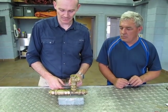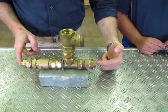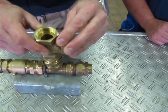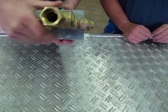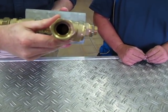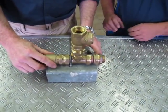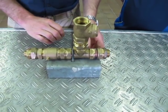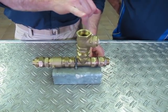The main components of the RAM pump are two valves. This is the inlet for the water and this is the outlet. This valve up here is a flap valve, a flap non-return valve which is normally open. As you can see there is a little flap here which you can hear moving at the moment. In here this is a spring non-return valve — just a plate with a spring in it. That valve is normally closed and this valve is normally open.